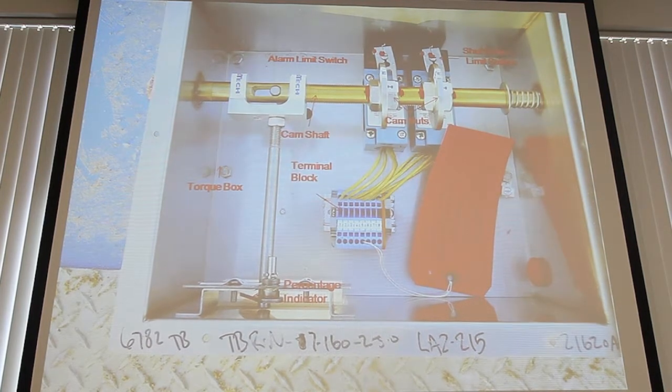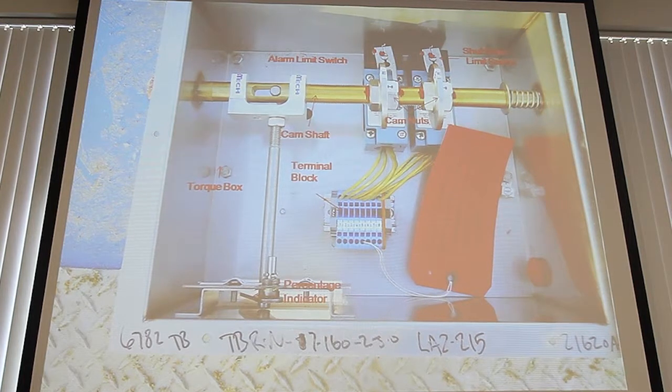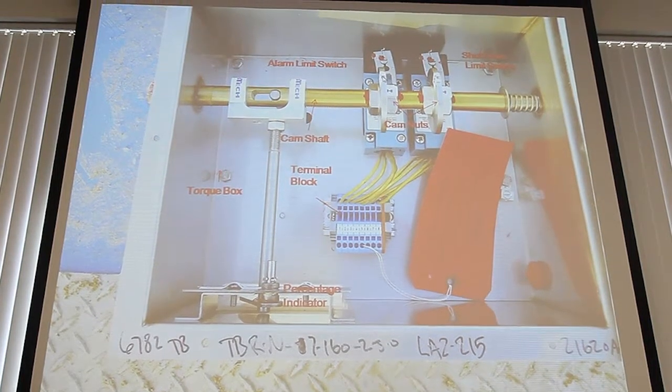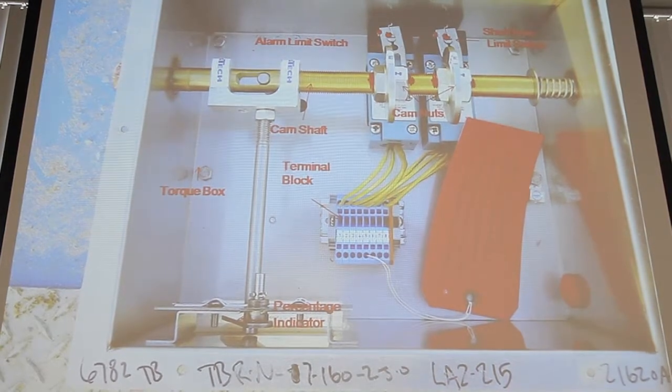We've heard stories of ladders falling in the clarifiers, even deer jumping in there and causing things to torque out in the middle of the night. So these are definitely good things to make sure you keep. These switches are really simple. You can see this little arm right here. At the end is a roller, and that roller contacts this flat plate right there. Once that roller hits a certain point, it shuts it off. Works pretty simple. They don't require any maintenance.